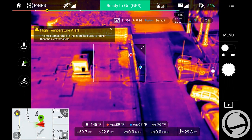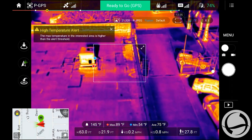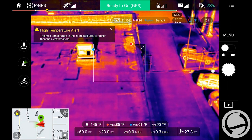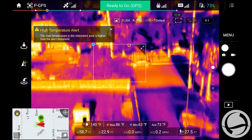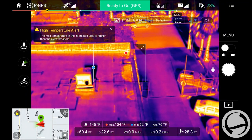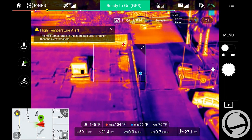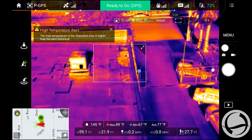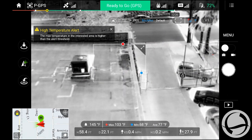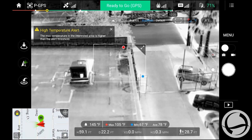Can you see that? That could be moisture trapped between the flat roof layers. Maybe the AC unit is leaking condensate, and it's getting into the layers of the roof. As the rest of the roof heats up, the moisture condensate is still in there. So that's why it's not the same temperature as the rest of the roof. Now, if I had an optical camera, I could say, oh, okay, that definitely isn't water. It's not pooling, it's not reflective. So that is a problem spot, you can tell. So that's the benefit of having the optical.